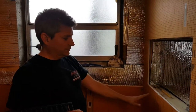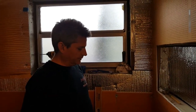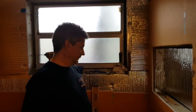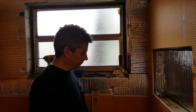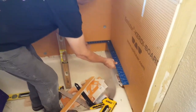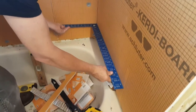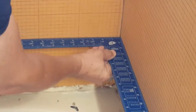Now that we're starting to put some of the Schluter panel boards up, this is true of any cementitious board or panel you're going to put up. You'll always hear carpenters talking about building stud walls and using the keywords: true, level, and plumb. It's the same here. I like to use my carpenter's square as I'm putting the panels up to make sure I've got an absolutely perfect 90-degree corner. Right in this corner here it's absolutely perfect. But if you look along here you shouldn't see any gaps where light is seeping through.